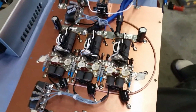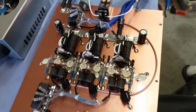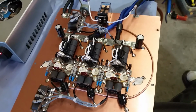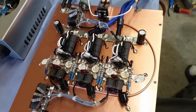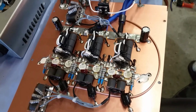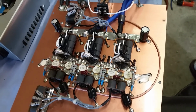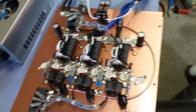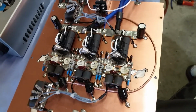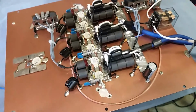So he changed his mind, just wanted a straight 6, and this is the style 6 transistor amplifier that I go by. This is the type of combination and splitting that is basically a hybrid style combination. They call them hybrid combiners. You can say it's a borderline hybrid combination system. It's still not implementing the step up or step down transformers connected with the ports, but this is the way it was taught to me by Mr. Stickman many years ago, and this has always worked very well with my 6 transistor design, so I'm going to stick with it. So we got you a straight to the point 6 pill here, man, that's rocking and rolling.